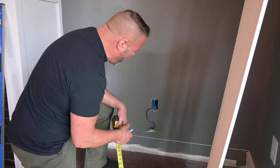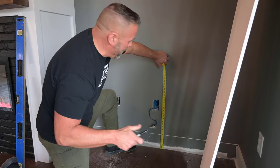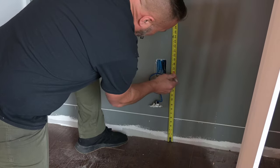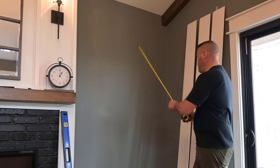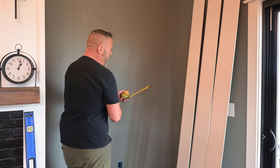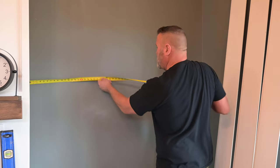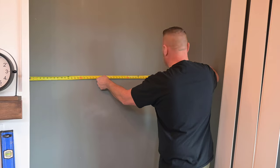My bench is about 16 inches tall, so I'm going to run a line so we know how long I need to cut my shiplap boards — about 16 and a half inches. Then all we have to do is measure down from the ceiling to the mark. We also have to determine center, so I know where to start my shiplap board. It's approximately a 64-inch wall, so we'll start the middle of my shiplap board at 32 inches. Pretty simple. Let's go cut some.